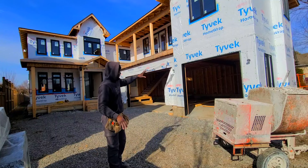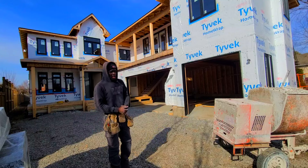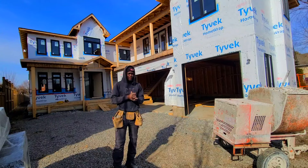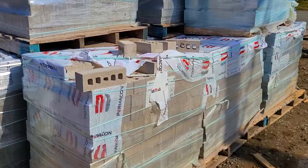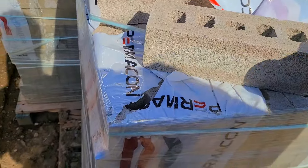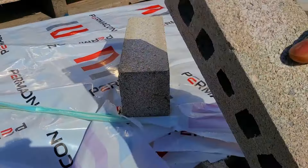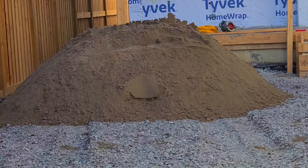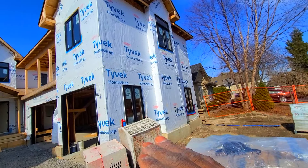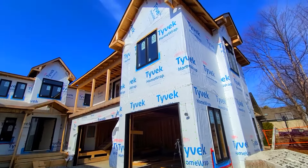In this series we're gonna be installing concrete bricks and we're also gonna install stone in some of the areas on this home. I want to give you a walkthrough to show you what it's like and what we're about to do. So we're gonna start here — this is the brick we're using, it's a concrete brick, it's a bit heavy. We're gonna use federal white mixed with all-purpose sand. We're going with a stone skirt going right around the front section.